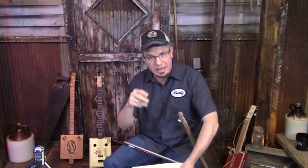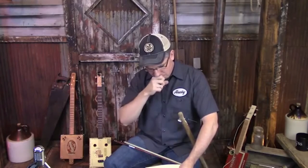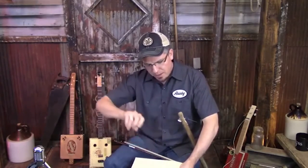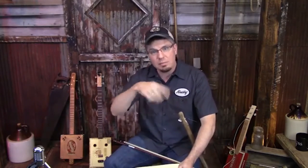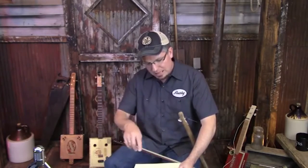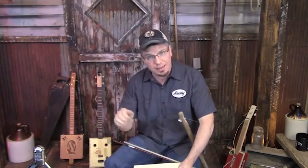But he's saying that if you carve a tapered peg or take a tapered peg off of a violin to use, the way that you taper your hole to fit is easily done by wrapping a piece of fine sandpaper once around the peg. With a rotating motion, sand the quarter inch hole to the taper of the peg. So you don't need a special reamer or a separate tool. You just put some sandpaper around the peg and use it to ream out the hole to the right size. But he says be careful not to go too deep. Take the sandpaper off the peg and fit it frequently, because if you overdo it, the peg will go in too far and you won't get the grip.